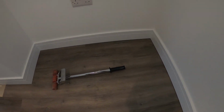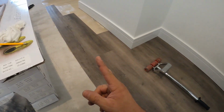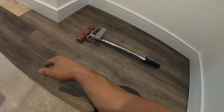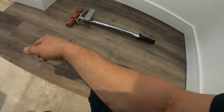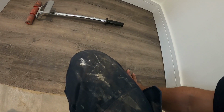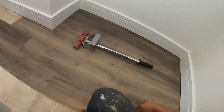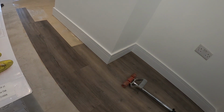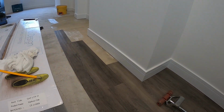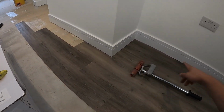Right, so this is how you get it done. In my case with this glue, I had to wait like 10 minutes before it gets not too runny, because the trouble is when it's runny you will want to slide around. In terms of fitting, if you prepare your skirting like I did, I put like 4mm packer to allow me to slide it under easily enough, and then I'm going to silicone with clear silicone afterwards to seal it off.